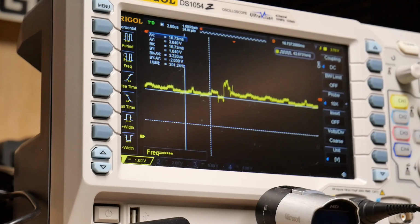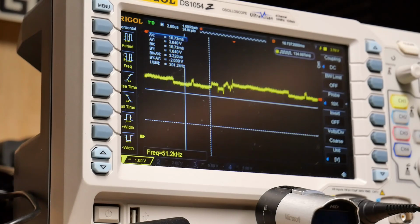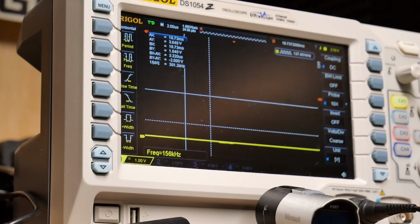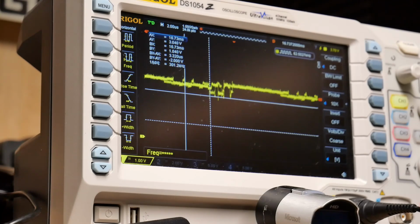When I go through these pins, they all basically look fine, and they're all high, except that one doesn't. Let me keep going. That's fine, fine. Yep, that's good. And that is good. That's all 7 on one side. And then on the other 16-bit, it goes high for a second, but I think that might be okay because every single data bit is either pulsing like that, or it's held high entirely.